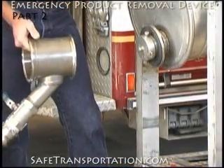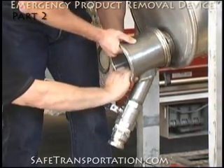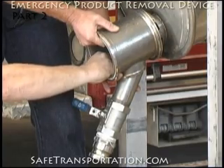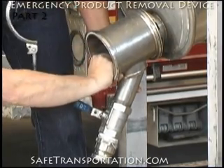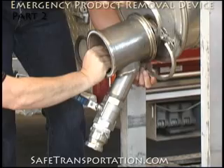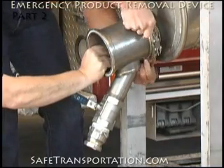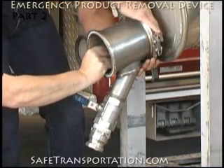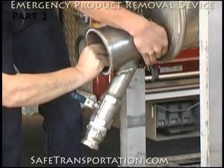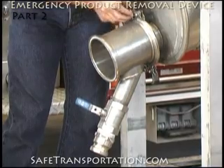The next part of the assembly process is to put the housing up against the Viton gasket. When you do this, it's important to keep good pressure on this valve to make sure that it won't come apart. After you apply pressure to it, get someone to assist you to hold further pressure on. Take your clamp — this is where it requires a little bit of trick work. Make sure you have it all the way around on both sides. Put your fingers around to confirm it's in, rotate it to where you can see where it's going to come together, press it in, and as needed loosen up the butterfly, then begin the tightening process.